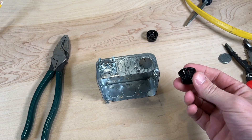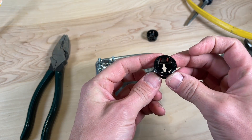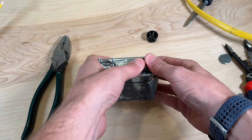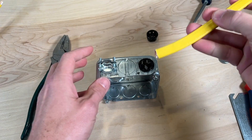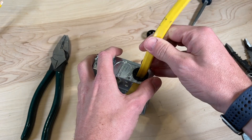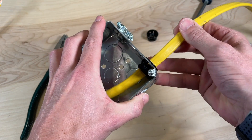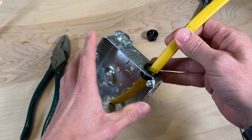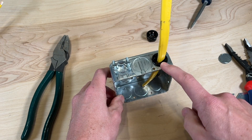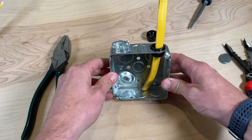Alternatively, you might have seen these small plastic ones. They're called connectors, but it's kind of a bushing and it does have strain relief on the inside. You just press that into place and it locks in, and then this is a 12-3 Romex — you slide that in and then you have strain relief pulling out. Now technically you can just keep pushing in because of the way the tabs work. This is not my favorite, but it definitely is easier to use.